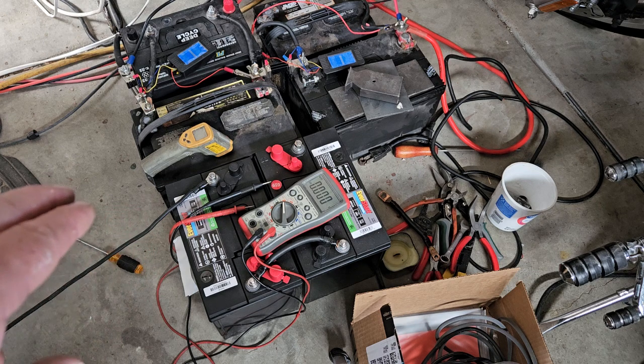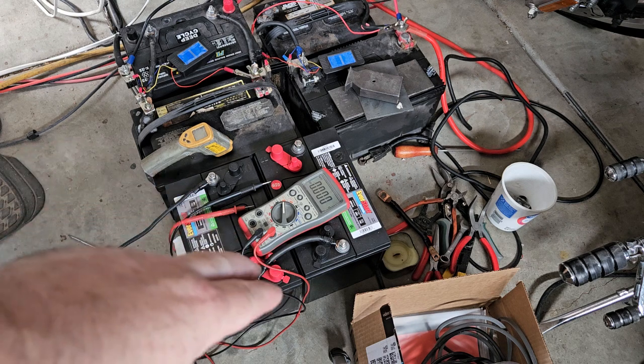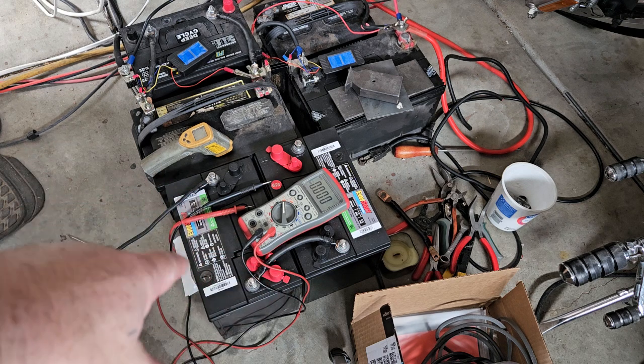The only thing I can think of is that the battery has boiled or cooked off some of the fluid, or it's sulfating — something has affected the specific gravity even though they're both holding the same charge. They were being charged at 24 volts.